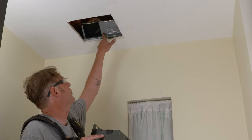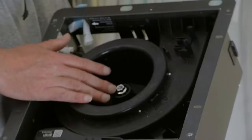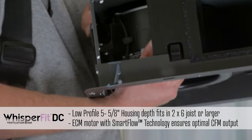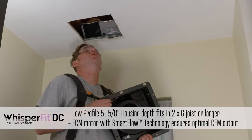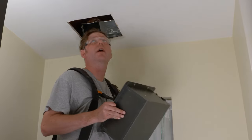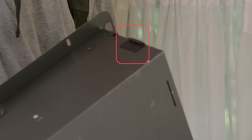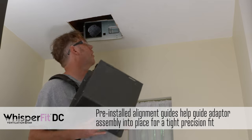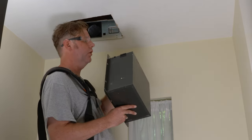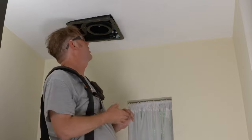There's a little plastic piece right here that's going to snap into the part where we did our wiring and ductwork. Here's our fan body and motor — as you can see, it's very low profile. It'll fit into a two-by-six joist space; we have two-by-eight in this old house. They have plastic guides on the end that slide up into the track, connecting to our already-done ductwork and electrical. There we go — now we're locked in.